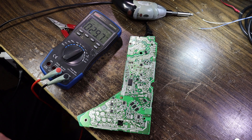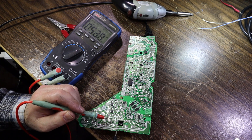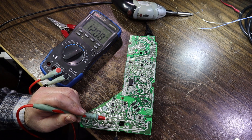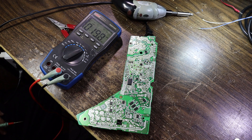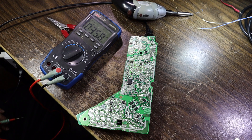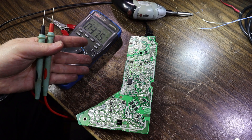After cleaning and plugging back in to confirm — it's 12 volts! That doesn't really make sense unless it was the conductive fluff. There didn't seem to be any overload on the main board. It's almost like a feedback loop issue where it was maintaining 9 volts rather than being pulled down. That's bizarre. Maybe it was just the fluff. Let's pop it back together — maybe I'll try the main board on a bench supply and see how that behaves.